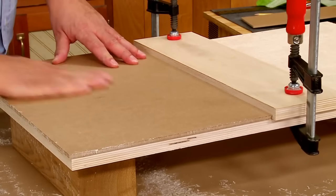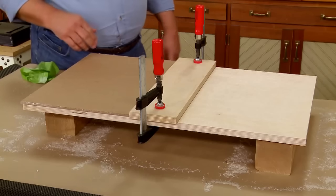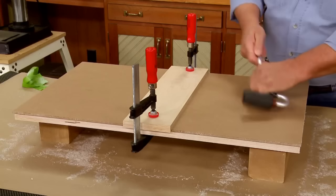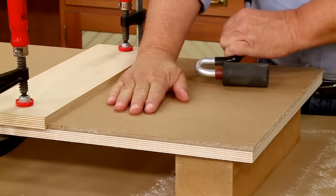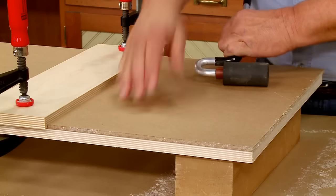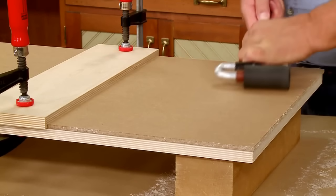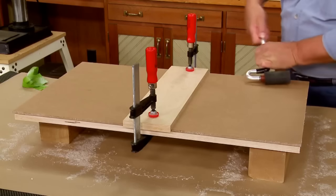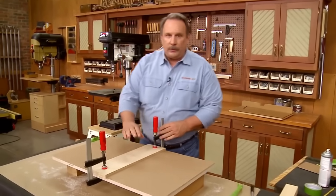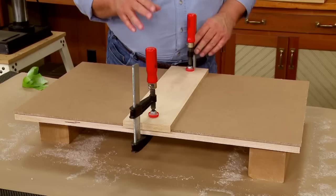The hardboard piece is down and overlapping. Now I can do the same thing on the other side. With both hardboard pieces down and contact-cemented directly to the plywood base, I use a J-roller to smooth everything out and make sure it's all firmly down. Now I can remove the center spacer piece and then come back to trim the insert to size to fit inside this beveled opening.